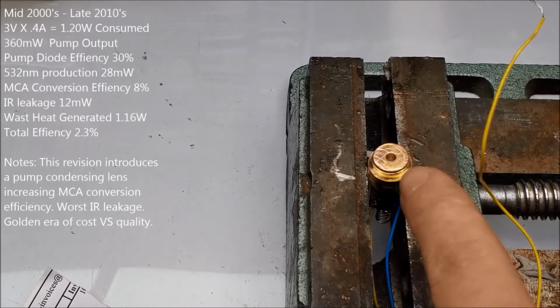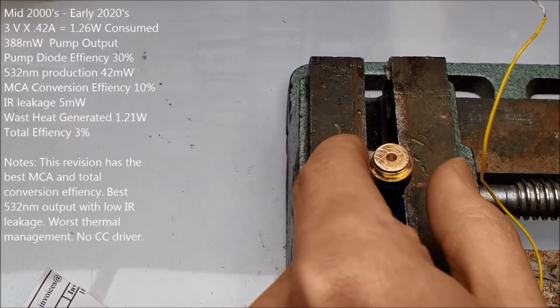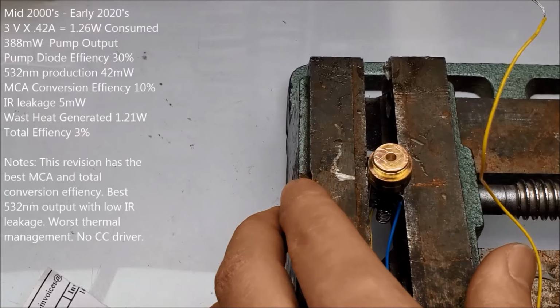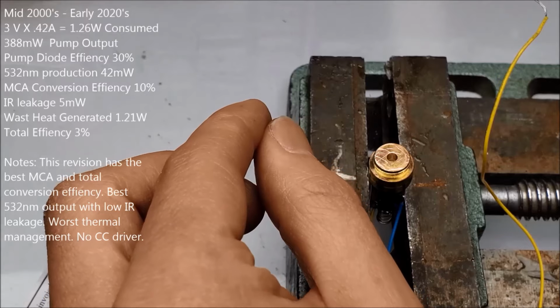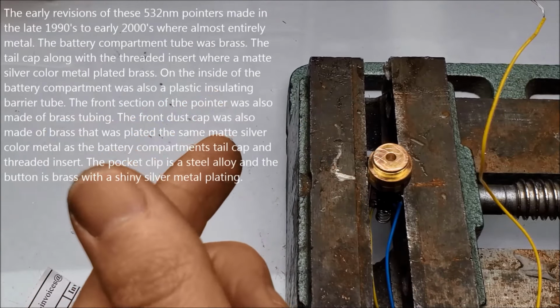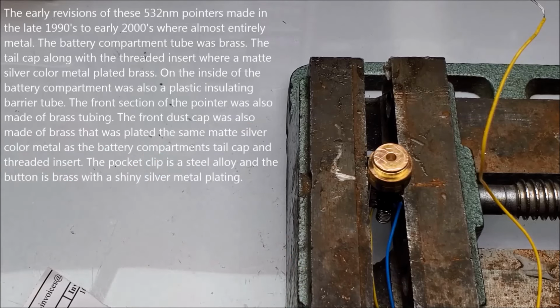It is very simple. All I'm going to do is just put epoxy around that top, and I'm going to set the MCA on top and see if I can find the best portion on the crystal. I'm going to start off with my power supply lower, so around the 2-volt range, and work my way up, so that way I don't also burn the glue that holds the crystal into place. So a little bit of a dance, but overall it's a pretty easy task. Let's get at it.